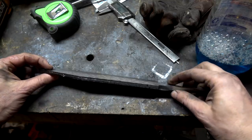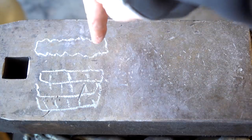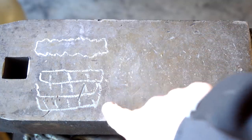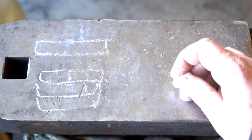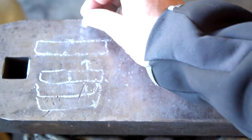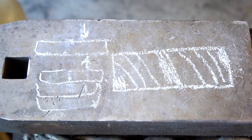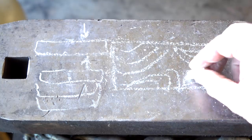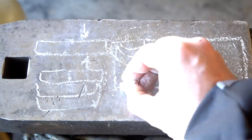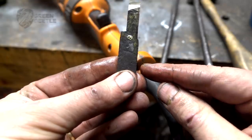I've given it a preliminary edge and it looks sort of cool - we've got those opposing twists, but it's definitely not what we're looking for. Let's draw pictures. Looking top down on our stack and from the side, the first thing we have to do is clean up the sides by grinding away the folds left over from twisting the bar. As we grind further into the sides of the blade, the pattern changes. From the side it looks like a candy cane. As we grind further into the sides, the lines start turning back towards the side they originated from, with loops forming, and if we grind almost halfway through the steel we reveal a concentric loop pattern where you get loops and circles across from each other and star-like formations in the middle.